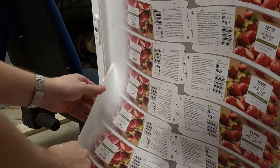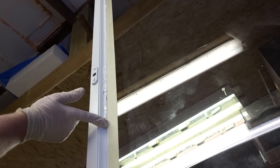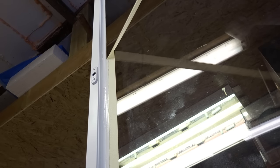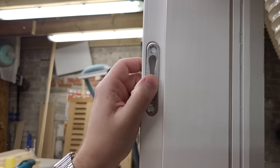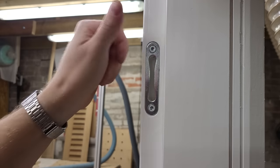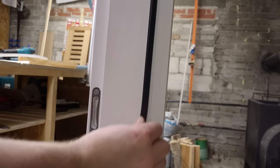There were some mishaps along the way. One of those was thinking I could paint over the old unknown silicone on the aluminum frame — the adhesion to it wasn't quite there. I was afraid water might start seeping under the paint and eventually cause problems, so I laid a new, even bigger bead of silicone over it, hopefully fixing the problem.